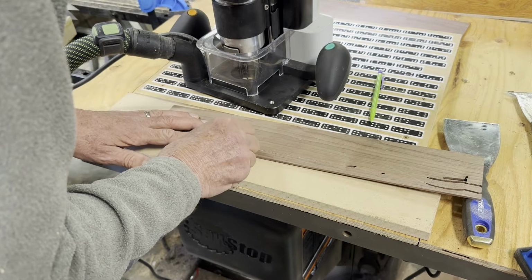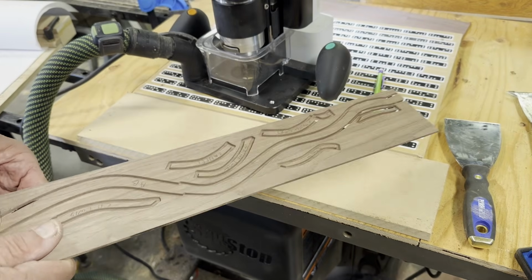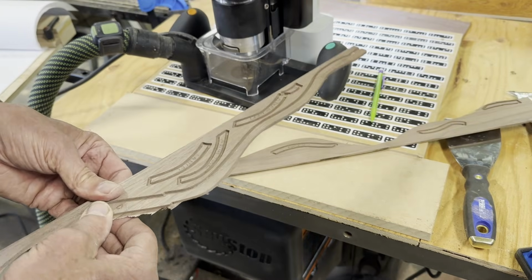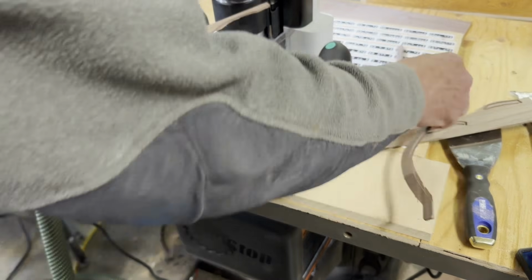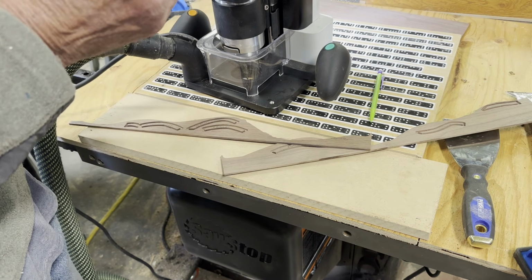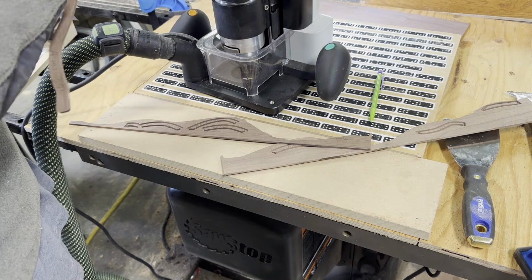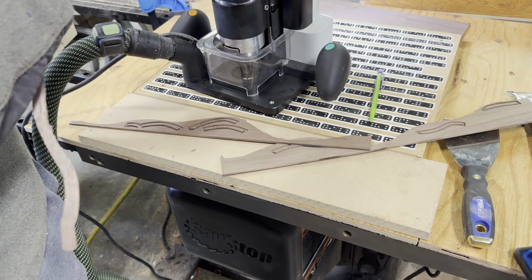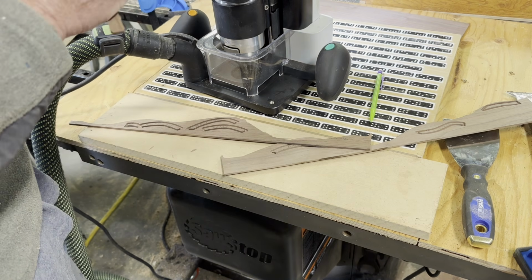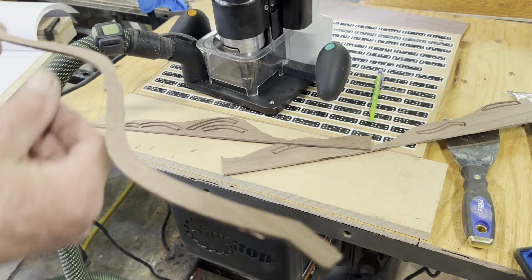If you're familiar with doing an inlay on the Shaper Origin, the idea is that you cut your positive parts first, and then you can use your positive parts to make sure that the negative inlay pockets you'll be cutting will actually fit. And to the extent that you need to adjust your inlay pockets, you can do that by using offsets and just actually test fitting as you go. I definitely suggest that you do some simpler inlay projects on your Shaper Origin or whatever your CNC is before you try to tackle this project.